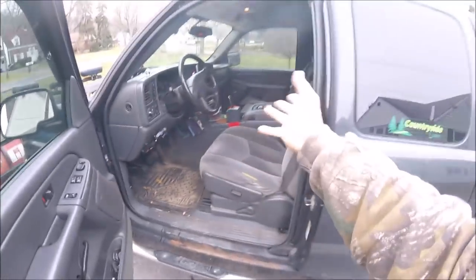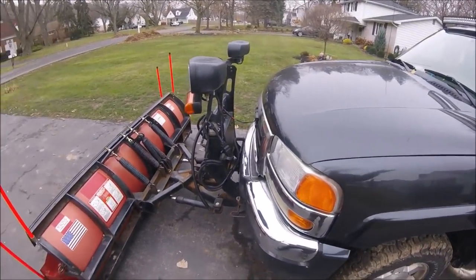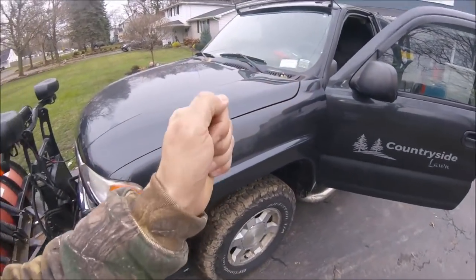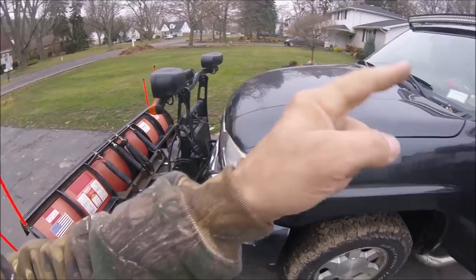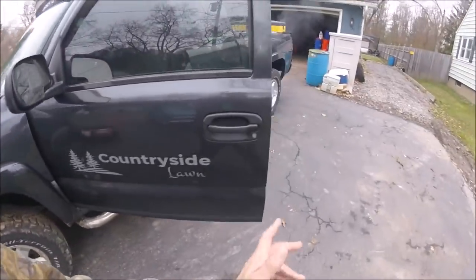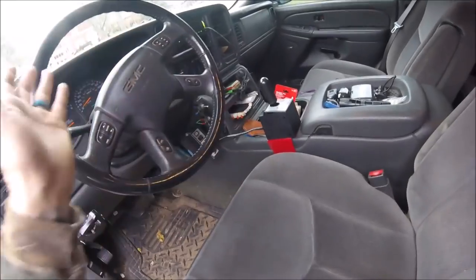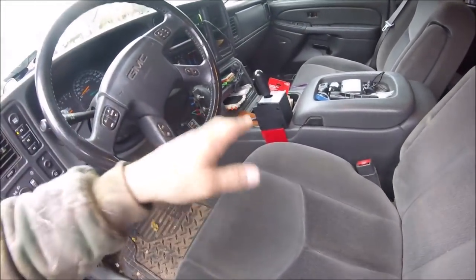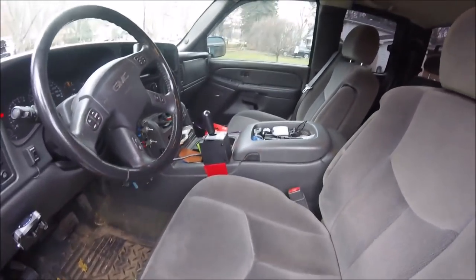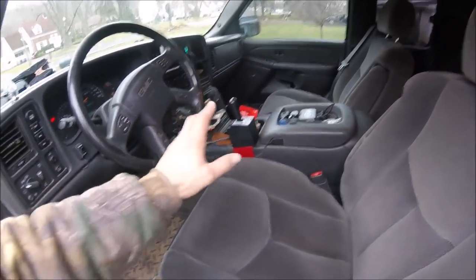It's the same plug — you just plug it right in. One of my questions was: if I push it all the way forward to where it's locked in float mode, is that the same as pushing the button on the handheld that lights the lights up red for hooking the plow up? Yes, it's exactly the same. You just push it forward so it locks forward, and that's your float mode for hooking and unhooking your blade, or for when you're plowing so the blade follows the contour of the surface. That is the joystick controller for Boss straight blade plows.